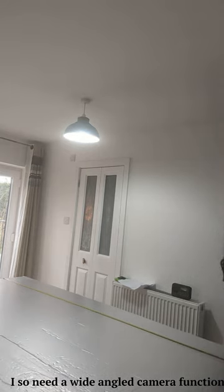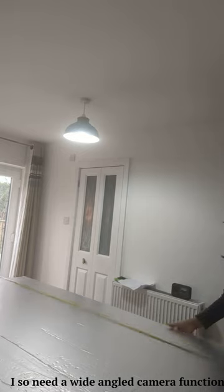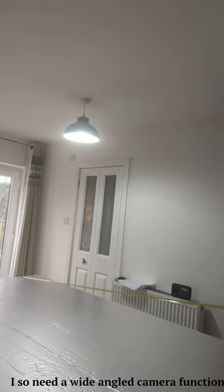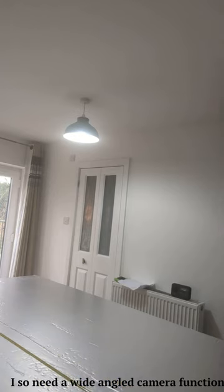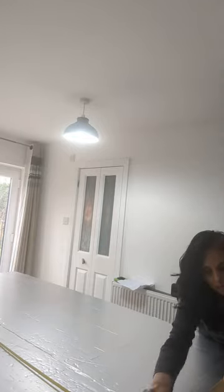and mark the 84 on both sides. And I will draw a line as a guide where my 84 sits. So that looks nice and done. If I were using a thicker board, I probably would do the cut in two phases. But as it's 40 mil, it's quite easy to do it in one phase. I'm just checking where my table is.